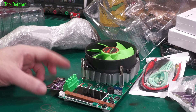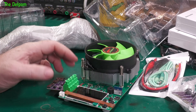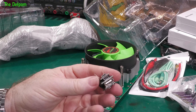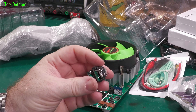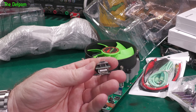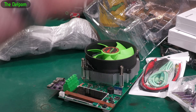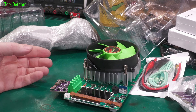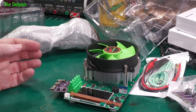There's an adapter here that plugs in here, so it'll go in there like that. You tighten the screws down to lock it in place and then you can plug in different USB ports and do testing with those. I thought it might be a very convenient way of doing some testing on tricky devices. I've got the Siglent electronic load up there — the proper Siglent load which I use — and I've got an adapter I made which hooks onto flying leads coming off there. I thought something like this might be useful because it does USB-C, which I can't really test very easily.